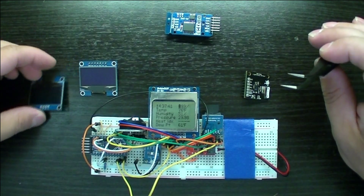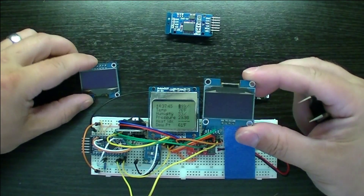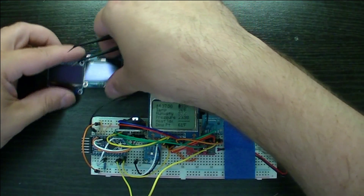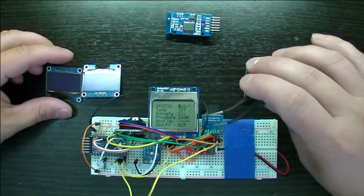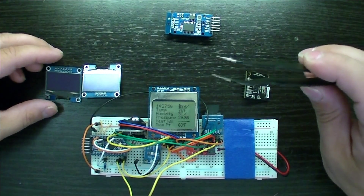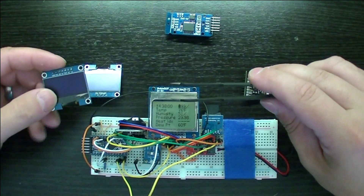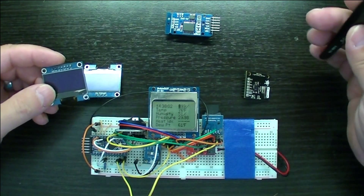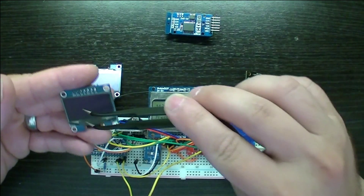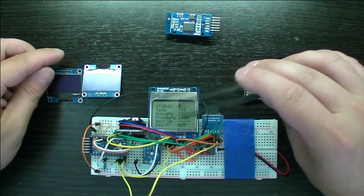I also tried using OLED screens, whether I squared C or an SPI version. I like them, but there are two problems. The one main problem is they pull too much power. When these were plugged in with the display always on, I was usually using about 5 milliamps for the amount of screen area that was lit up — that was too much for my power budget for this unit.